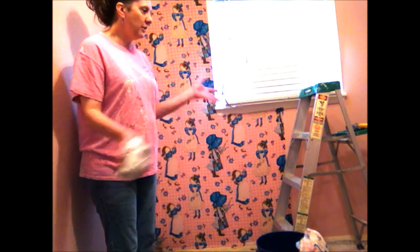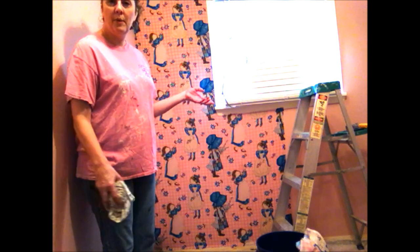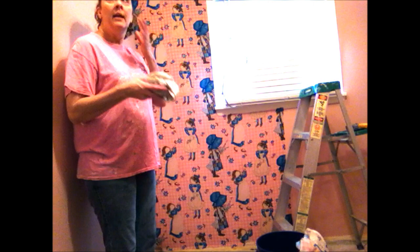I'm not having to change out the baseboards in here — there's stain and paint on them because the plan was to go around and repaint just the baseboards, but I don't have to replace them like in other parts of the house. Chris already got the molding done in this room. I cut the fabric about two inches longer than needed, and when fitting around a window I left a little bit over on the side in the corner. I folded under a lip of about an inch so if it shrinks more than expected I can always re-moisten the section with more starch and pull it over.